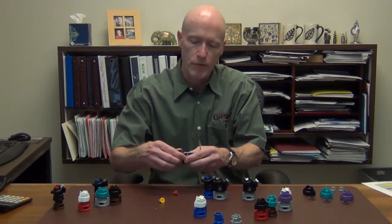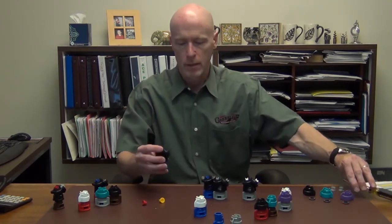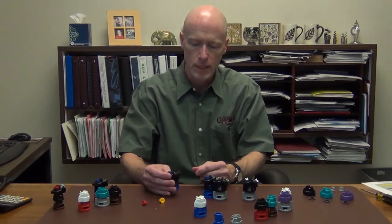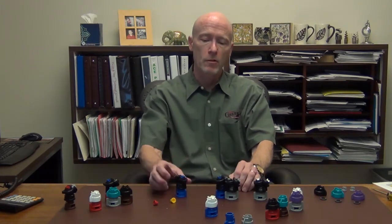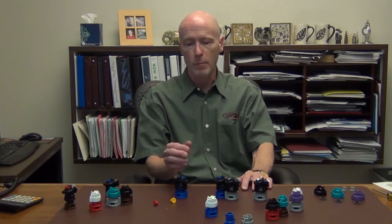And you can always switch back if you're going back to something like the Liberty or a fungicide that needs better coverage. You switch it back to the standard version for those applications. It's really important with these nozzles, and when you're using Monsanto's XtendiMax herbicide, read the label, follow the instructions of the label, because they're different from some of the other labels that have been out there in the past. Additionally, there's a website called XtendiMaxApplicationRequirements.com that is an extension of the label, and that's where you find the list of the nozzles that are approved and the operating pressures that you have to operate each nozzle. It's required that you go and look at that website to see if there have been any changes.